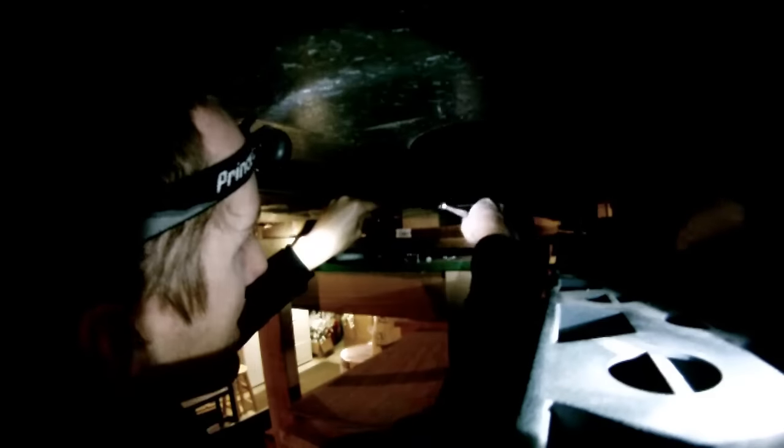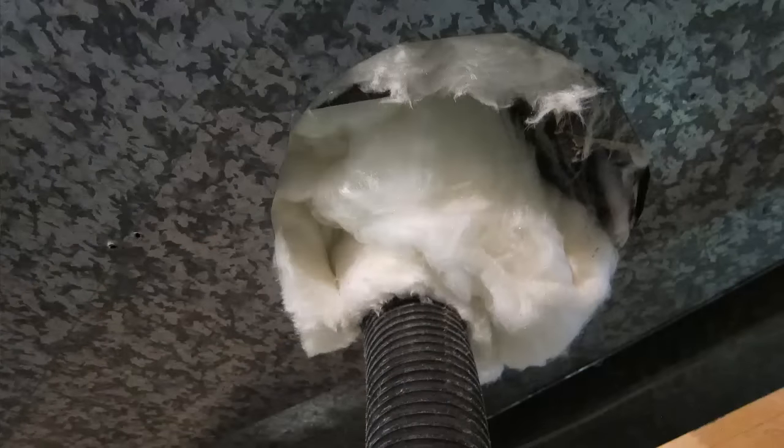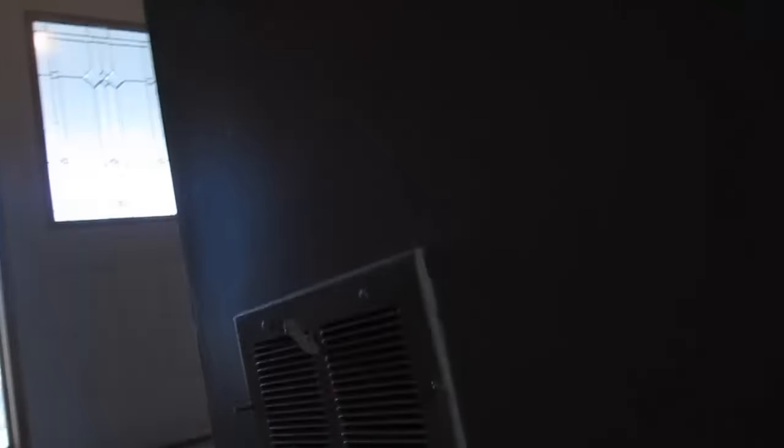I can just take these plates off — this is where I'm going to hook up the shop vac. That was the last sheet metal screw, so let's take a look up in there and see what it looks like. That's pretty bad. My original plan was to use cardboard to block air from getting back into the furnace, but I found some extra insulation in the basement, so I'm going to use that — shove it up in there to block all the dust from getting back in. Most of the heating vents I could just lift off, but some need to be unscrewed, like the ones on the wall.